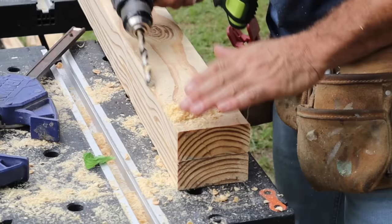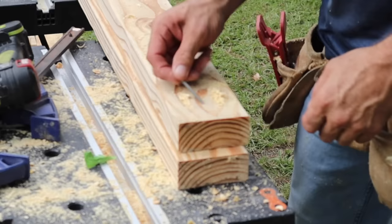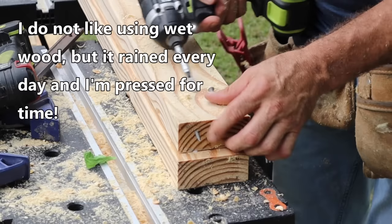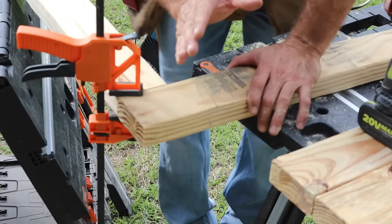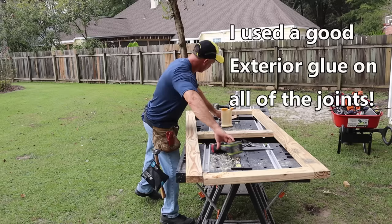When I lay my screw in, I try to get it in flat — I don't let it go in at an angle because it'll come out the side. I lay it as flat as I can. That's why I groove it way back. You want to try to screw your end grain into your cross grain whenever possible. There are times I have to do it the opposite way, but I glue it and there's not a lot of stress. For structural work, always screw into the cross grain.